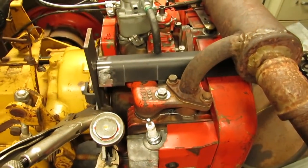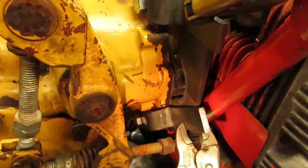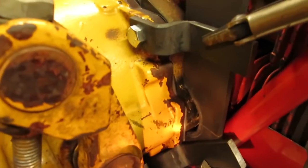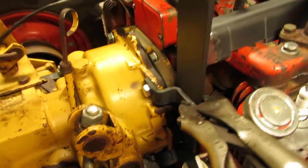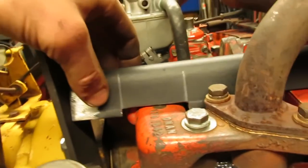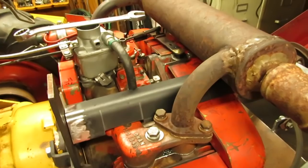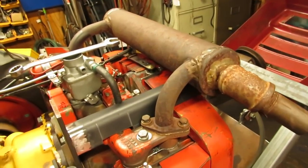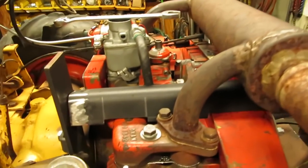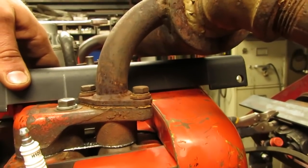Here's what I have so far on the hydraulic pump bracket. I bent up some one-inch flat stock and jogged it over top and bottom for the engine mounting holes, then attached a piece of quarter-inch plate notched out around the bump in the engine adapter plate. That comes up to the top and lets me run a piece of angle iron across the top of the engine where the hydraulic pump will come out the side. The angle iron is notched to sit down around the intake manifold and shroud so I can still run the stock exhaust muffler for driving through the woods.